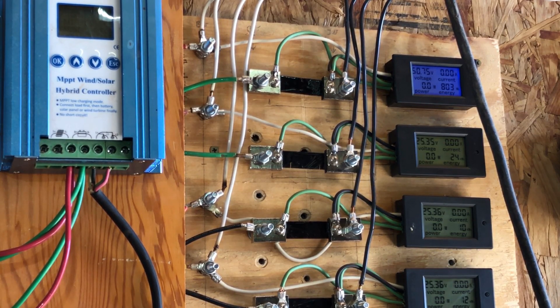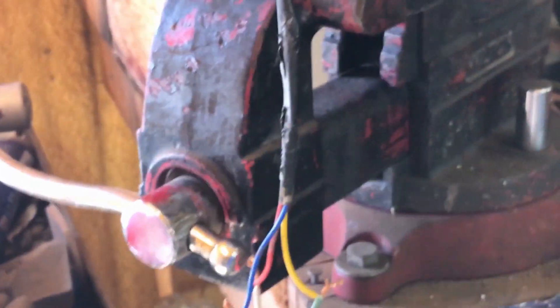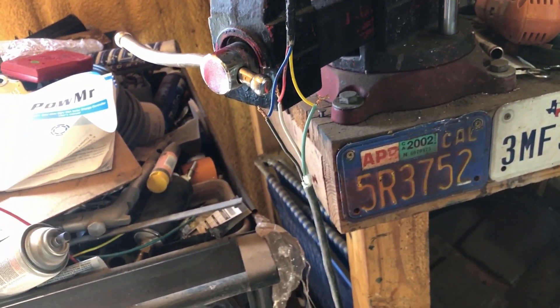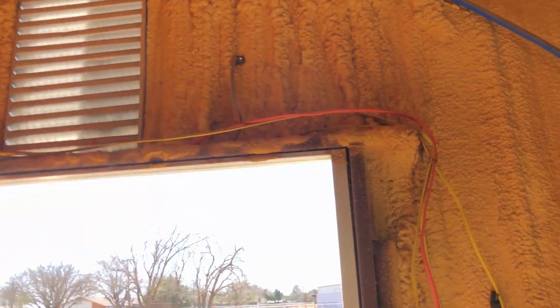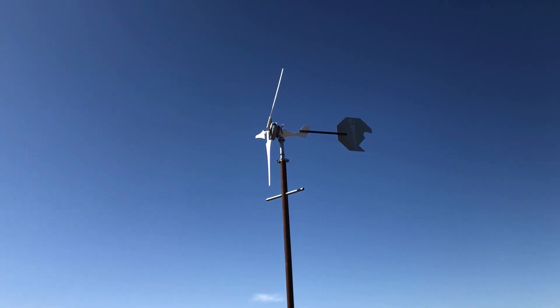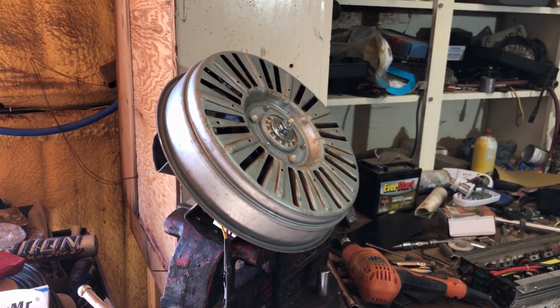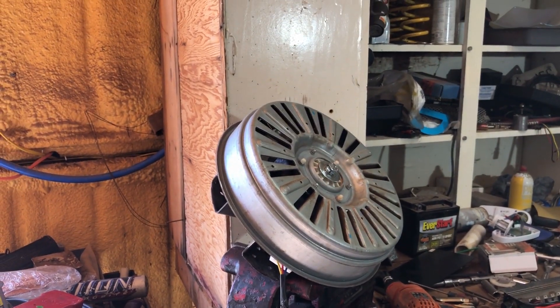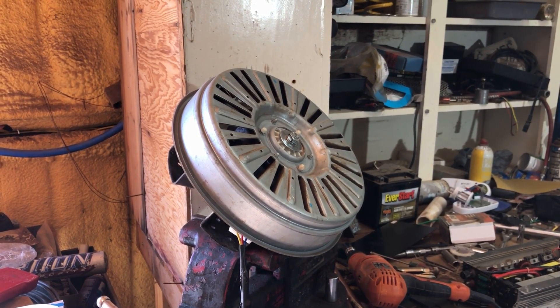So that's neat — that's what we've got going on. I'm going to run this stator at 48 volts. We're going to come back very soon to talk about blades. I'll go about it the same way I made the hub on the other turbine — take some strap, cut it at 120 degrees, make a little three-bladed hub, and then put some airfoils on the ends. Boring update maybe, but we'll have more interesting stuff coming up very soon. Thanks for watching, guys — have a wonderful day.